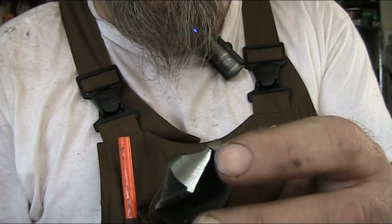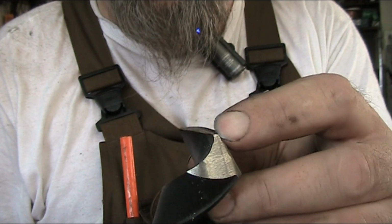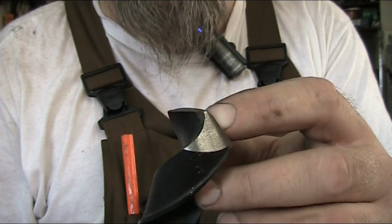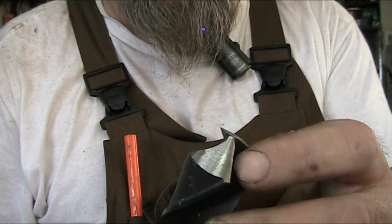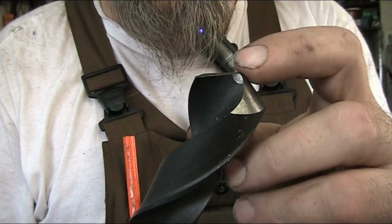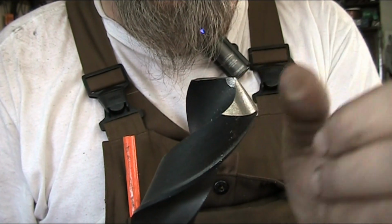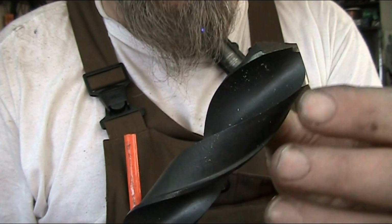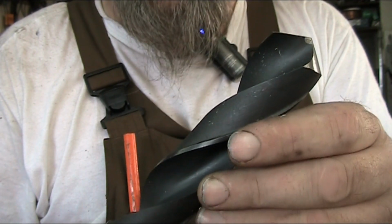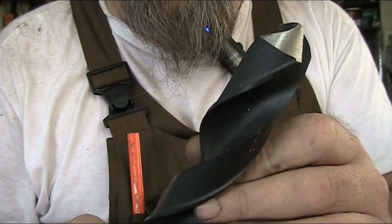Now in these small drills, this doesn't cut. It doesn't cut wood. It will scrape a chip off in steel because it acts like a chisel. And if you look at this, you've got essentially cutting edge almost all the way across, except for a very, very small part in the middle, and that's where this tip comes in. And then also you have these flutes here, and these have a pretty sharp edge on them. Some of you guys probably made your acquaintance with them already, where you've gotten cut on them.